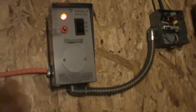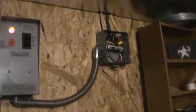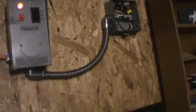What they did is you wire this near your panel and you take the circuit your furnace is on and wire it through here. So if your power goes out you can crank up a generator — there's a plug that goes here, but I hardwired it. You can plug in your generator and fire up your furnace. I'm just using it to fire up a circuit that comes into my garage.